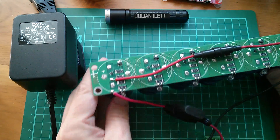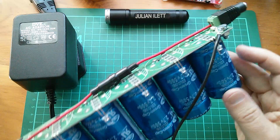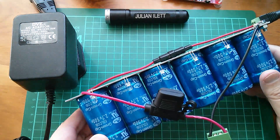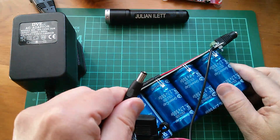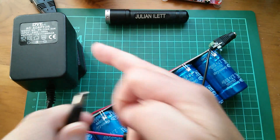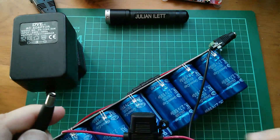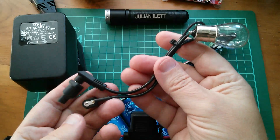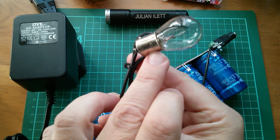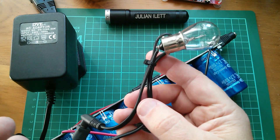Just so I can do a practical experiment, I'm switching to this other super capacitor bank - 2.7 volts, 500 farads each - mainly because it's got this plug already attached. There's a fuse there to protect it in case of overcurrent. I could plug that directly in, but that would put these completely discharged capacitors directly across the power supply, imposing a dead short. So maybe another way: if I take this bulb - it's a little overloaded, going to be taking maybe one and a half, perhaps nearer two amps, whatever 21 divided by 12 is.